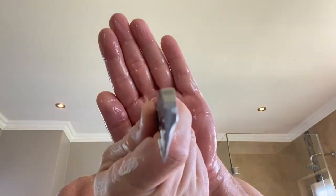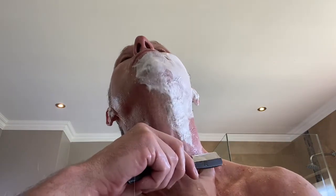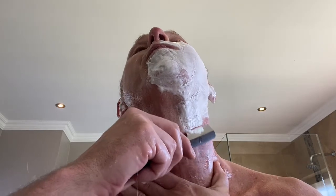Because it's an asymmetrical grind, and if things are true, these razors were made so that your partner could shave you. When somebody else does it, the blade face — the ura — will always be facing away from the skin. The back side is always flat against the skin — that's how that person would be shaving you. Generally people try to do that, but it's definitely not required. If an edge and an apex are set correctly and you've polished it, both sides will be sharp. It's just about understanding the angle and slightly adapting.